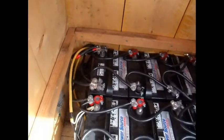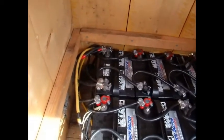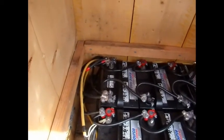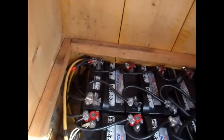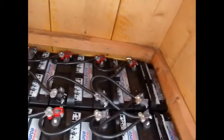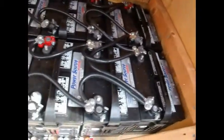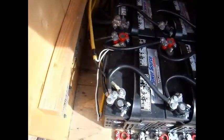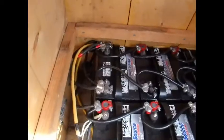I've got two sources that come in. One of them is the solar panels, and the other one is my big pickup truck as a fail-safe. Electricity comes in at those two terminals, positive and negative, and they're on a parallel circuit right through all eight batteries, and back out to where these two terminals go off to the inverters in the house. So you draw off the input on that side, output on this side.